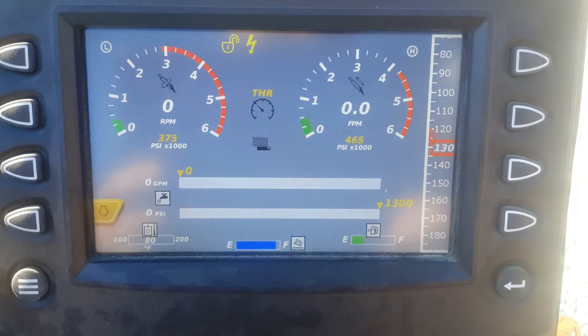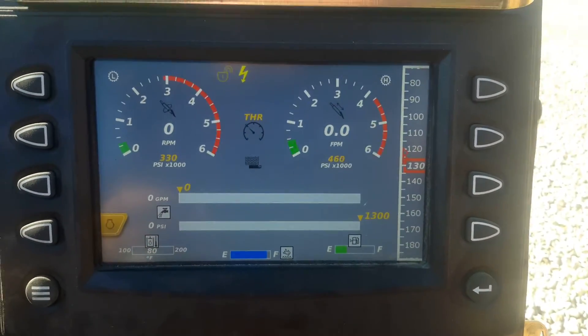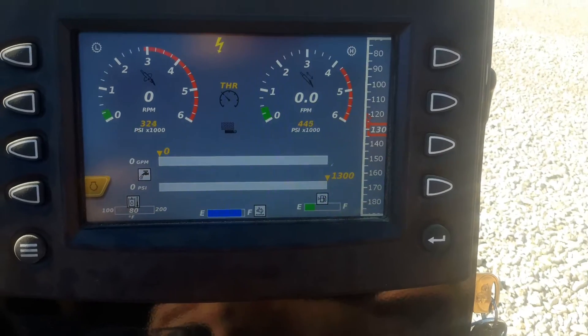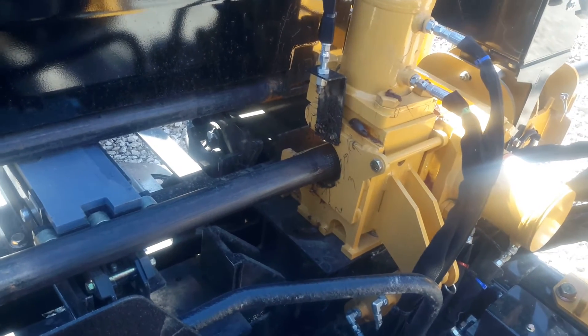Make sure when you look over here that you're at 130-131 inches after you pull back off of the rod with your drive motor. If not, it's still attached to the rod in the back and then we have a hang-up issue.